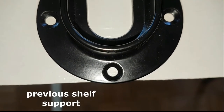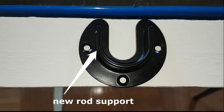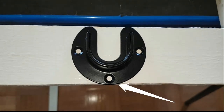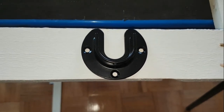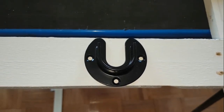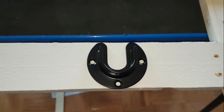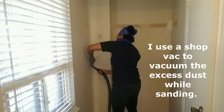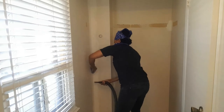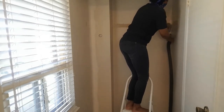This is why I decided on getting a wider shelf support: the new rod support is wider than the previous shelf support, and the bottom hole where the third screw would need to be placed is way too close to the edge — it would have split the wood if I tried to secure the new rod support properly. So I needed a wider shelf support. Back inside the closet, I get to sand down the drywall compound I applied earlier and make sure the walls are nice and smooth before painting.